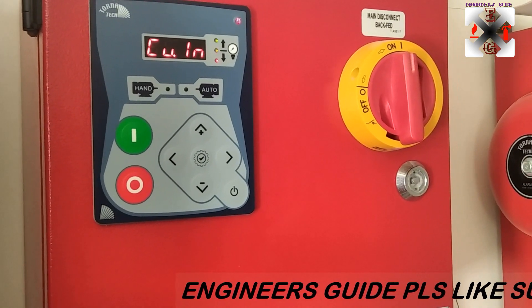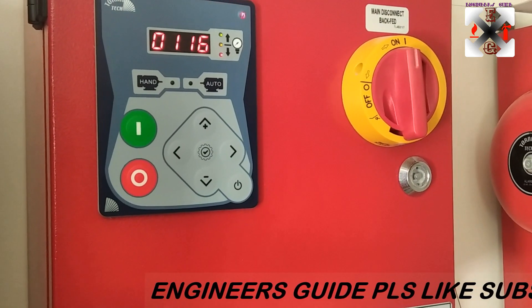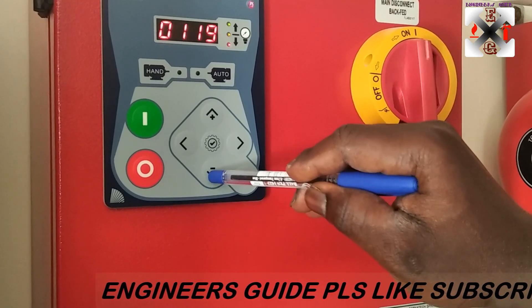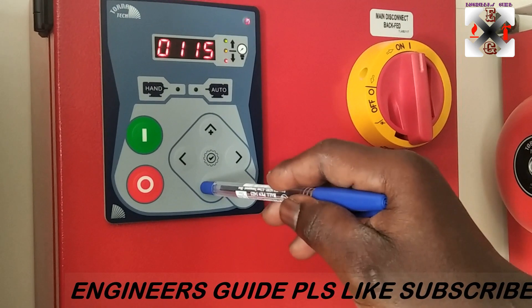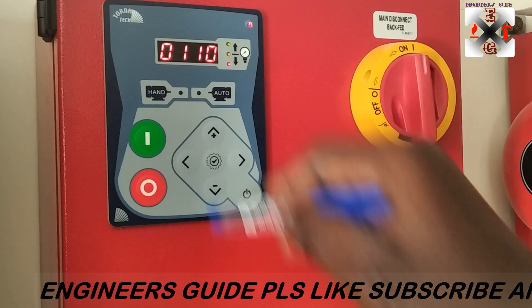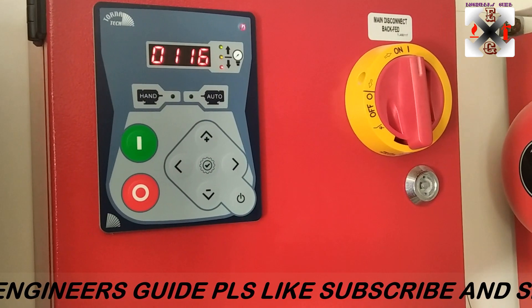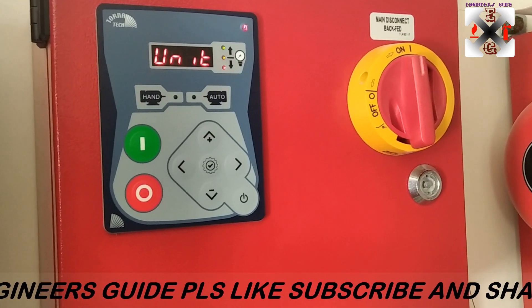This next screen is the cut-in. Press enter to edit it — it is currently 116. If you want 120, you can top it up to 120; if you want 115 or 110, you can bring it down accordingly. For my settings, I need 116, so I'll just press enter and move to the next function.